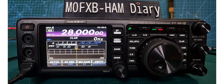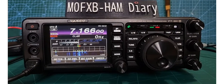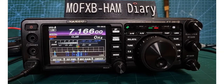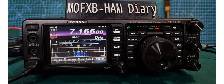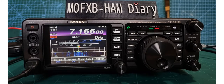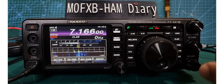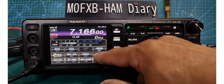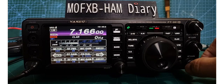Welcome to my channel — looking at the automatic tuner on the FT-991A, which I think is a fantastic radio: all-band, all-mode, and C4FM. We've got an HF antenna — a 9:1 balun with a length of wire. It needs tuning. Our RF power is only at five watts. To change power: press F menu, go forward or back until you see RF power, then change it with the multi knob. It shows five watts and goes up and down.